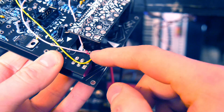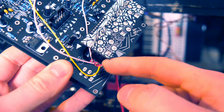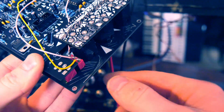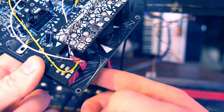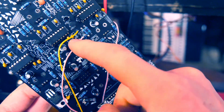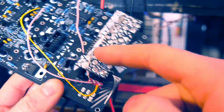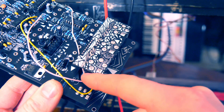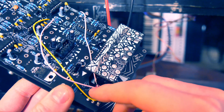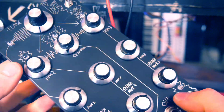The pad where it was connected — that's where the yellow wire is — goes over to the bottom switch. When this switch is enabled and those two are connecting together, that means it's in normal mode where the signal is connected and everything's fine. If you want it to become completely wet, you flick that switch and it connects straight to the positive leg of C31. There's a slight volume boost with this because it loses a gain stage, but that might be good news for some people.